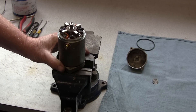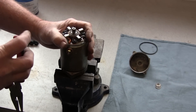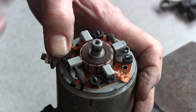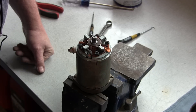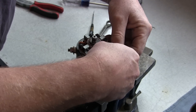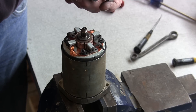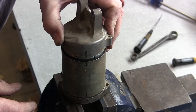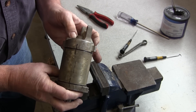It's much easier to put the assembly in a vise to hold it while you do the finish assembly. What we're going to do now is make sure we get the springs onto the brushes — pull the spring down on all brushes and make sure they align in the slots in the back of the brush. Now install the shims on the comm end, the top o-ring, make sure it's aligned. Grease the end cap and align the marks that we put on before — now the marks are all aligned and we know we're all set to put the screws back in the unit.